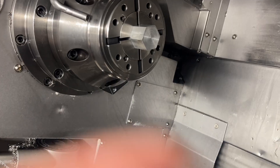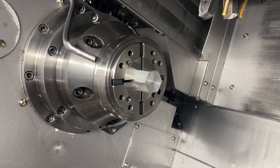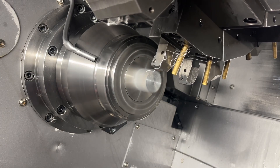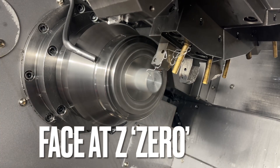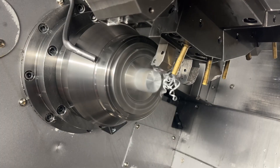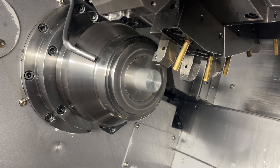We're going to move over to Z0. I'm going to position this here. So I'm at Z0. I'm going to bring my tool in here, turn on my spindle, and I'm going to face it off at Z0. Essentially now I am telling the machine where my Z0 is at, facing it with a known tool. This is aluminum so you can be a little more relaxed about it. If this was stainless or harder steel like Inconel, I wouldn't do this. I usually go to about a thousand RPM and manually jog it down. Now our Z0 is touched, but we also have to give it a diameter.